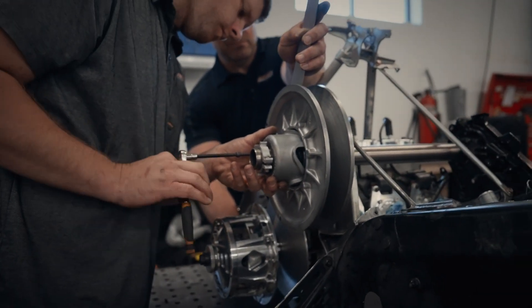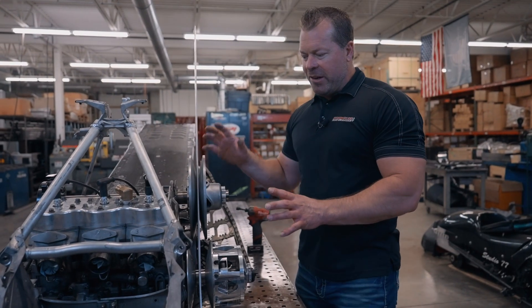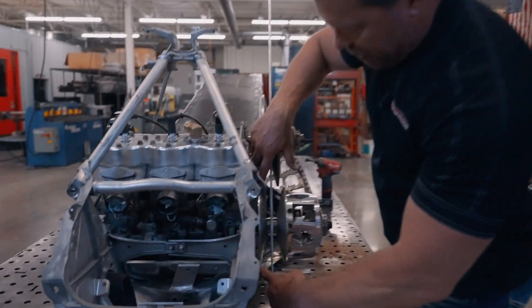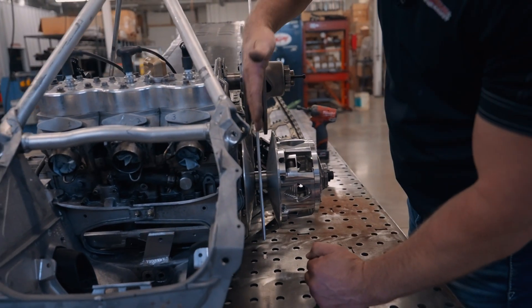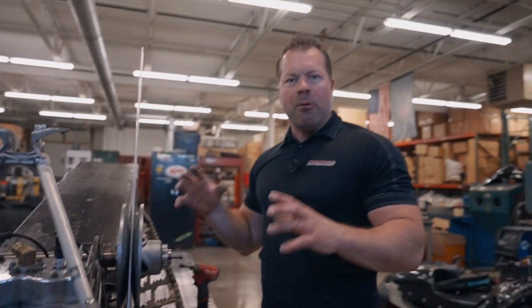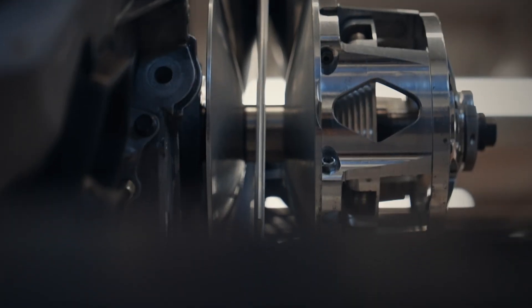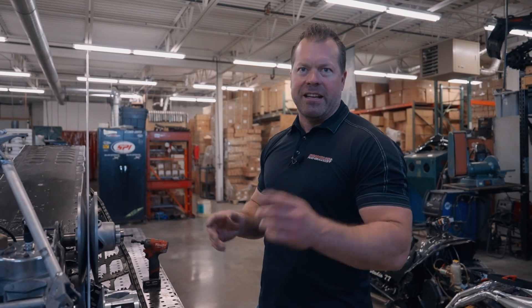We're not perfect today but we're close enough to continue with the build. We have shimming and some finals to do, but we wanted to make sure the distances between top and bottom are the same, we have the offset right, and we have trueness. We wanted to give a quick recap on how we did that so you can see what's going on, because a lot of people ask how to align it — here's a quick tip on how to set it up.